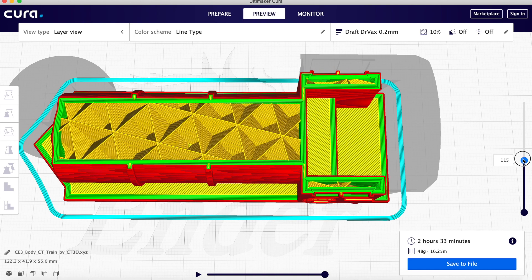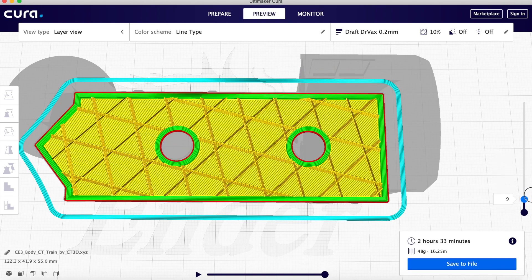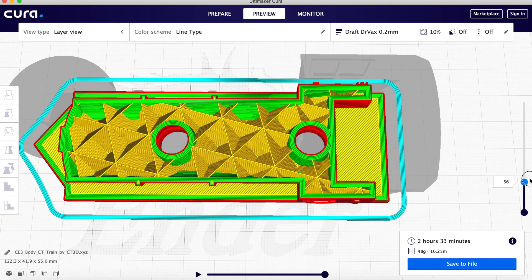One way to make your object stronger is to change the infill pattern. A grid infill pattern will be very good at resisting crushing forces pushing down, but perhaps less good from the sides. However, we can change the infill from grid to cubic and re-slice. This infill pattern — if we scroll up the model, we'll see it reverses back and forth — is actually a three-dimensional fill. Cubic is a three-dimensional fill, so it will support the model in both directions.